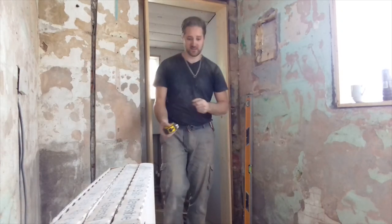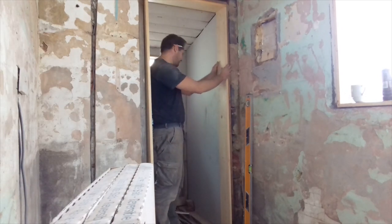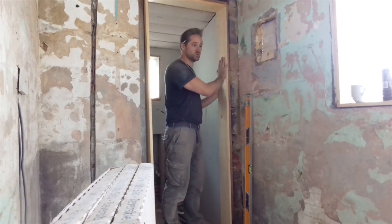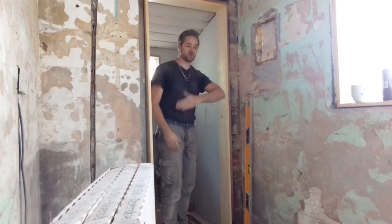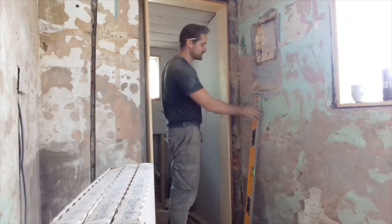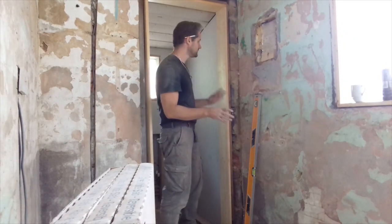Now there's a couple of ways of installing a door liner — there's the right way and there's the wrong way. To do it properly you do need to do the door first. This is my door side, so this is the bit that's going to be hinged. There's no point getting it all perfectly level and saying that's the way it's going to be, because sometimes the door is not always perfect — all depends on how it's stored in the actual shop. It could be slightly warped.